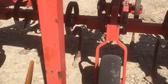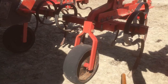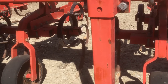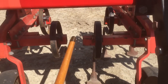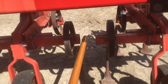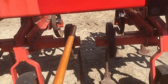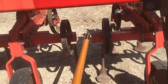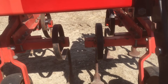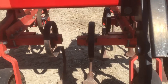What we're going to do — we've just got everything assembled. We don't have any teeth on yet; you can see the teeth on this cultivator are in poor shape. But we have the 30-inch row set up. The next thing is to set those bars so there's just enough gap that the row units will clear each other, and then that will allow me in the field to change the shanks and put them where I want. We'll probably leave about a three-inch gap between those two bars, get our spike teeth on, and we will be able to roll in the field.